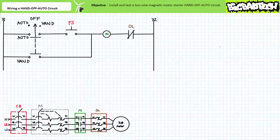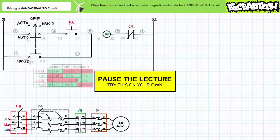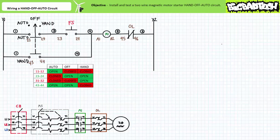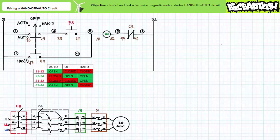We are ready to build this circuit — really two separate circuits: the pilot ladder logic and the primary circuit. Our previous applications exercises were single-level circuits; this is our first two-level circuit that uses pilot level elements to control the state of primary devices. Let's begin by assembling the pilot level circuit first, then connect the primary devices afterward. This order allows a technician to test or troubleshoot the pilot level ladder logic without worrying about the motor. First, insert terminal and wire numbers on the ladder logic diagram. Wire one is the left-hand vertical upright and wire two is the right-hand vertical upright.